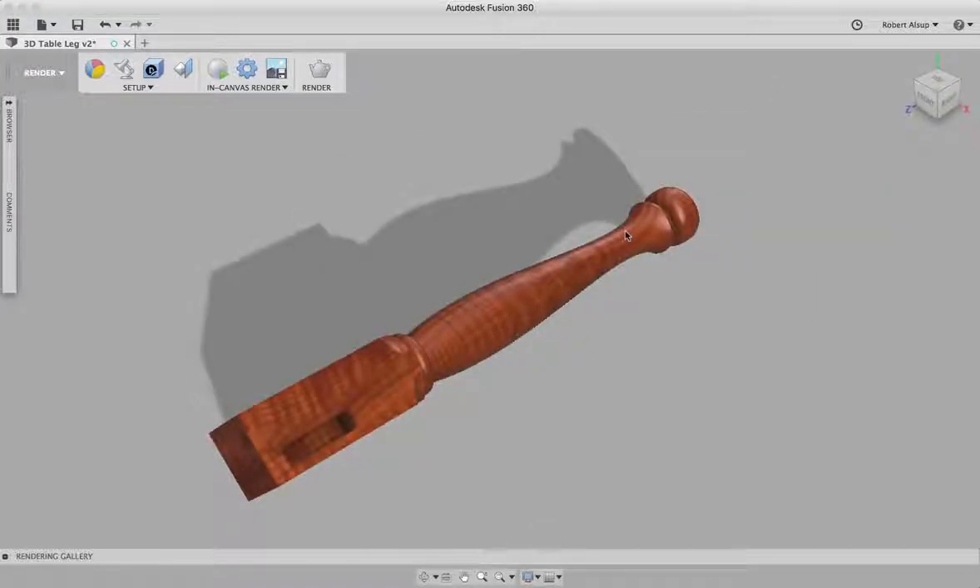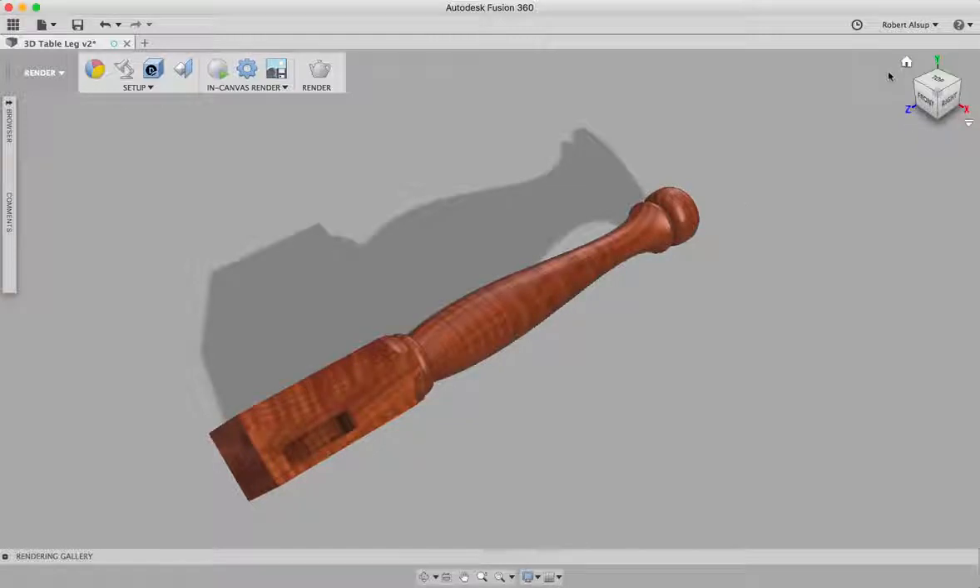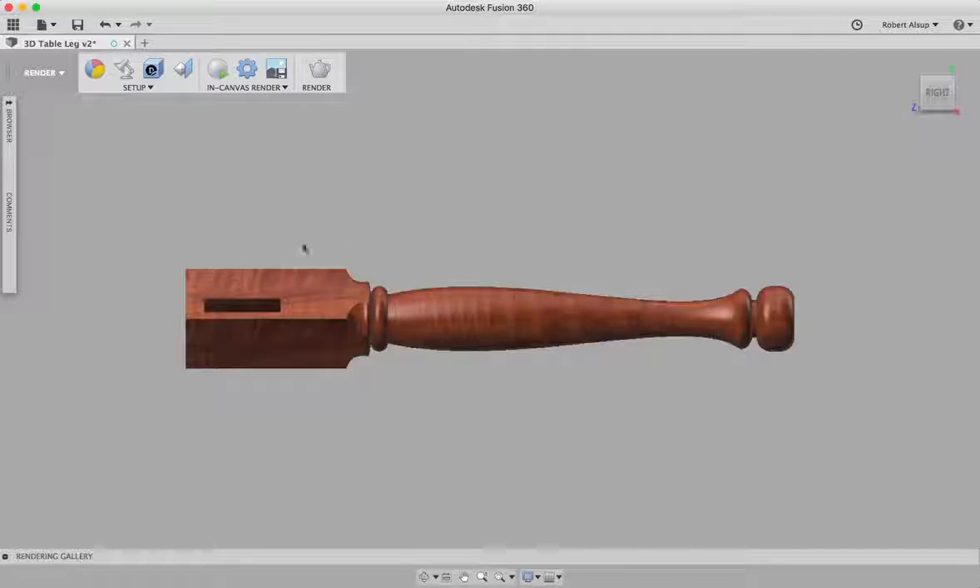To start this out, we're going to take a 2D profile and revolve it 360 degrees to form the object, then cut the corners off. When you actually create the profile, you need to have enough material — shown diagonally here — and we'll cut the excess material off. I start out with a drawing that represents half of this profile. You could do it in Fusion 360, but I think it's easier to draw in VCarve Pro, and we're also coming back to VCarve Pro.